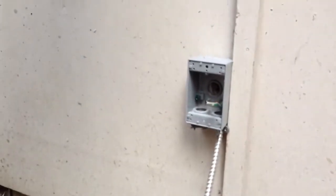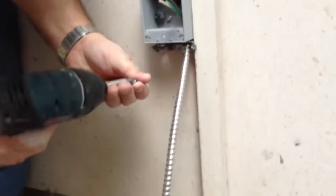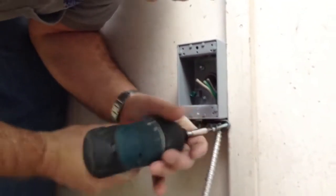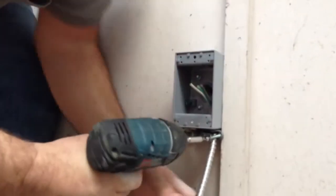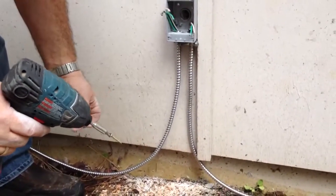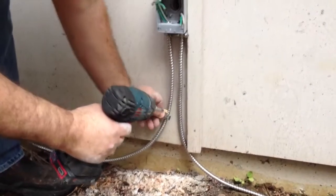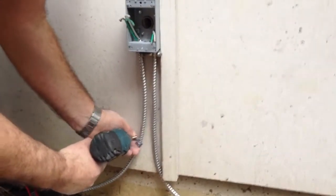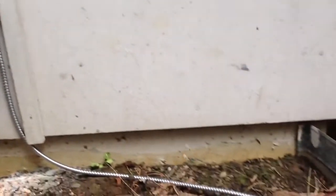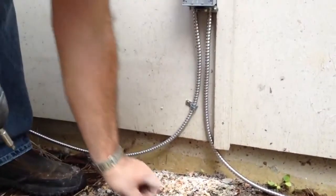Let's see what we can do here. The screws on this clamp are pretty long. I've got my two different lines coming out of my junction box, so I'm going to secure the cable right now using these little cable clamps — I'm going to put some screws in them. It just helps keep the wire nice and tight to the building.